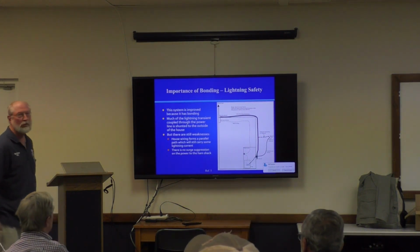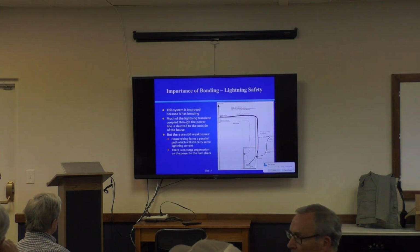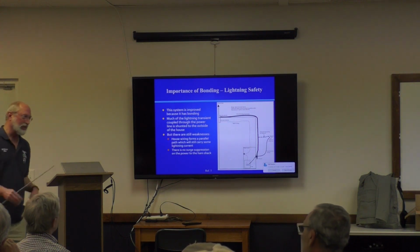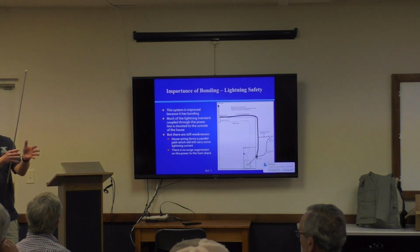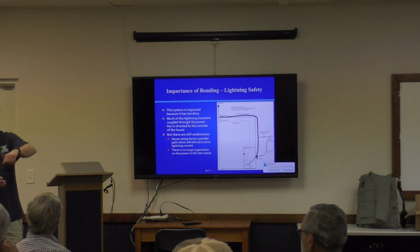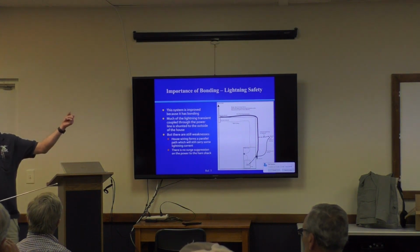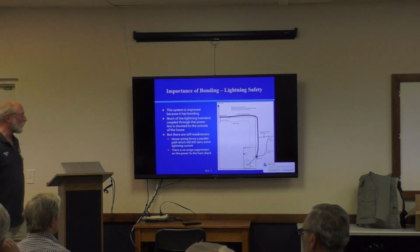And that's thousands of people with refrigerators, stoves, toasters, all kinds of stuff. I remember the old toaster. People have been killed by toasters. It's like the classic kill case for faulty appliances, right? Because you've got a bunch of hot lead wires in there causing your wires to glow. And if one of those wires breaks and then happens to touch the chassis, you might have a 10 or 20 ohm resistance to that. Well, 10 or 20 ohms at 120 volts is enough to kill you. It only takes 50 milliamps or so to kill you. So it's not much.